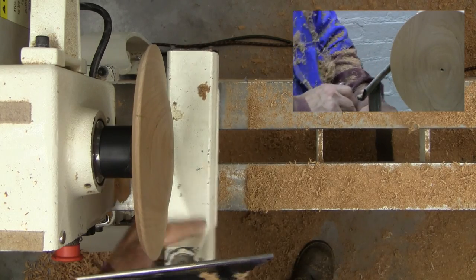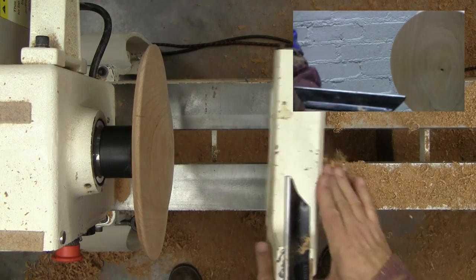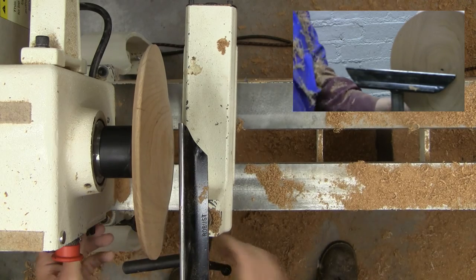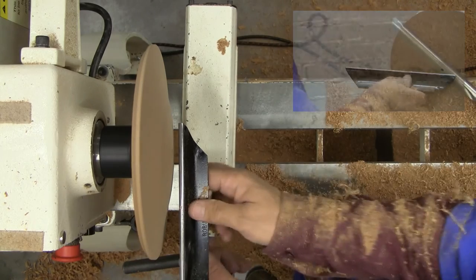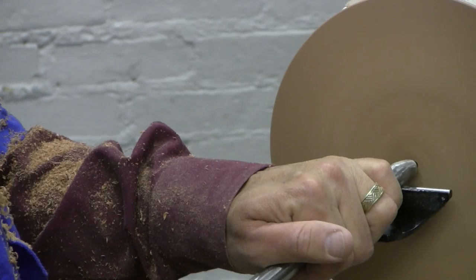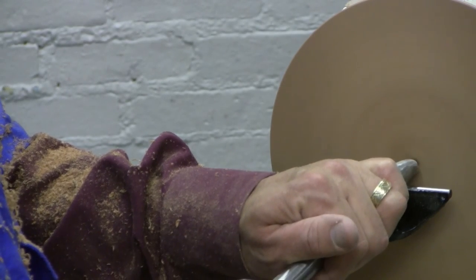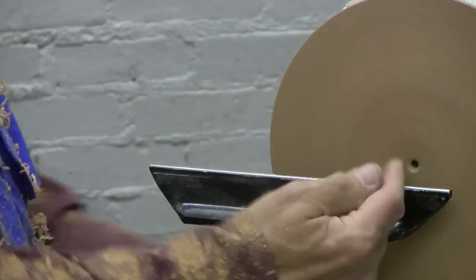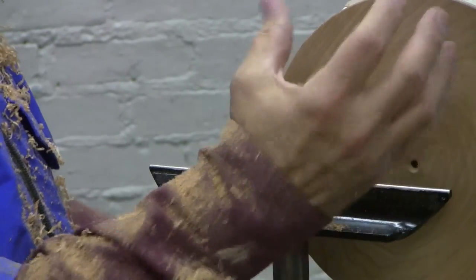One more thing, and this is what is kind of critical to keep it from chipping out like that one I was passing around did. What I'll do is I'll just cut a little bigger hole right there at the surface. That won't be visible because the knob will cover it. But what it does is when you're screwing it in, when the screw starts hitting, you've got some fiber support there, so it's not so likely to chip it out.